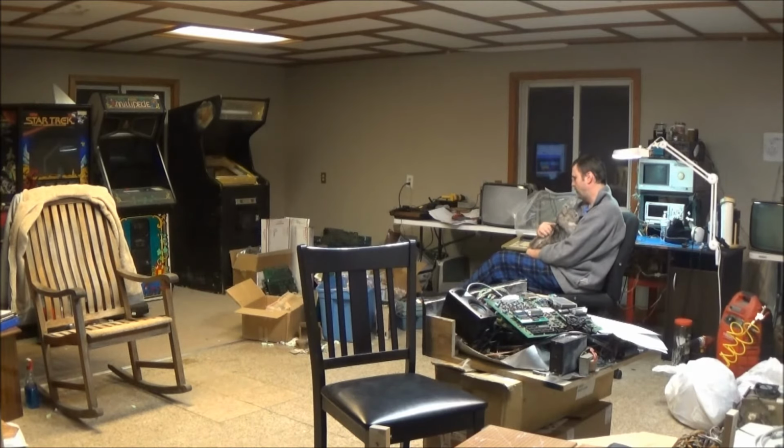So what I want to do now that I've recapped this board, I've recapped the Robbie Roto set, is take a good Astrocade chip out of my Wizard of War, put it in here, and use the two good RAM boards and the pattern board out of that, and just see if I can get Robbie Roto to come up. And I have to repair his pattern board.